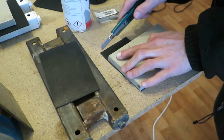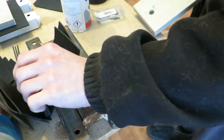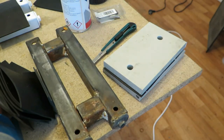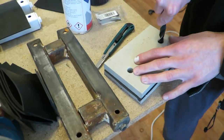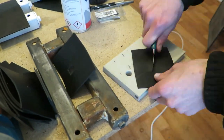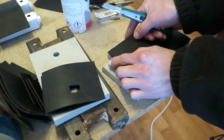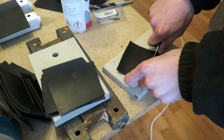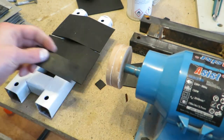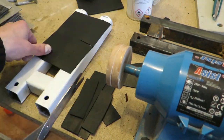I will prepare sealing gaskets where I will make two small holes. I use a drill to mark the positions of the holes, but pressing the rubber with a finger where the hole is leaves a nice contour. This contour is then cut by a sharp knife. To fix imperfections of the support, I will add rubber cutoffs I have left from making the gaskets.